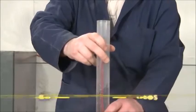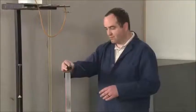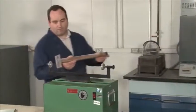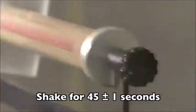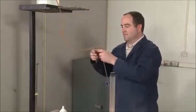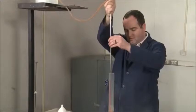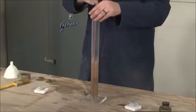Remove trapped air by tapping the bottom of the cylinder firmly with the heel of your hand. Allow the wetted sample to stand undisturbed for 10 ±1 minutes. After the 10-minute soaking period, loosen the material from the bottom by tilting and shaking the cylinder. After loosening the material, place the stoppered cylinder in the mechanical shaker and allow the machine to shake the cylinder for 45 ±1 seconds. At the end of the shaking period, set the cylinder upright on the work surface and remove the stopper. Insert the irrigation tube and rinse the walls of the cylinder as the tube is lowered. Apply a gentle stabbing and twisting motion to force the tip of the irrigator through the material repeatedly to bring the fines into suspension.